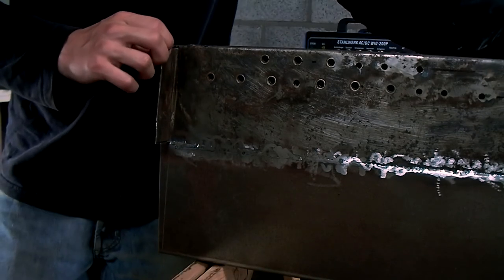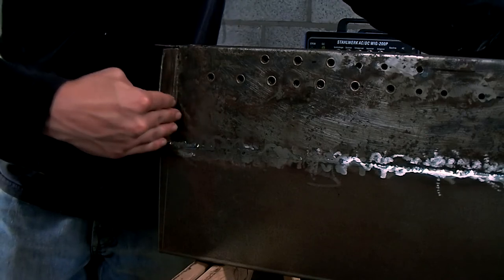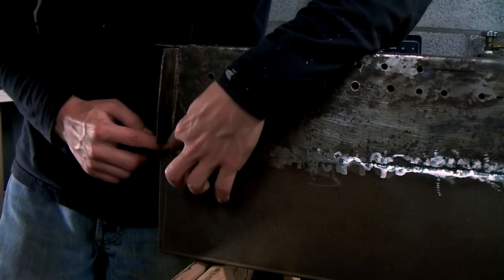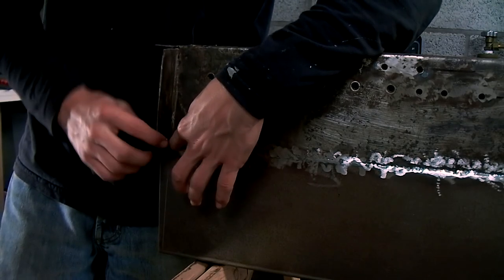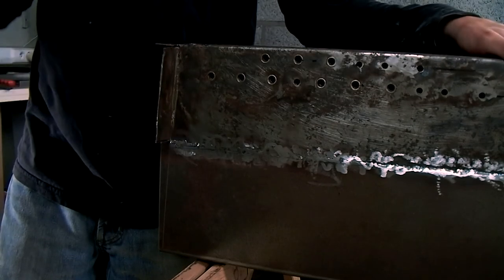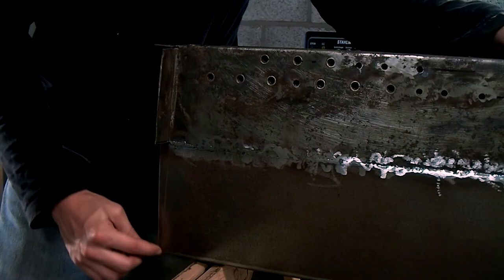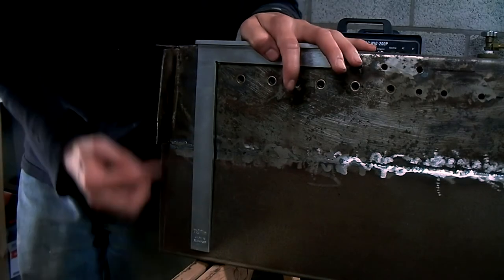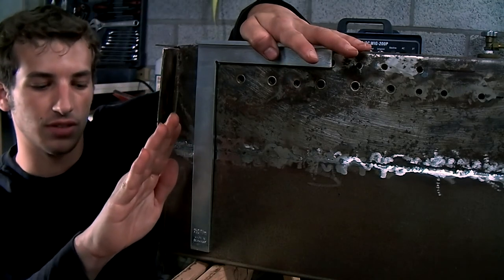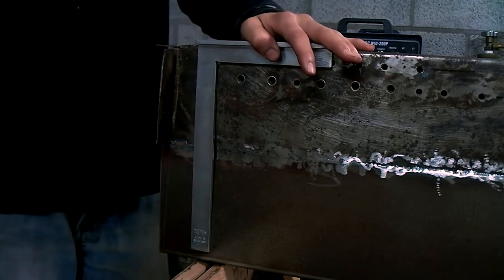The second reason is because it's only welded on this edge, there's a lot of slop in here, and this piece of plate could move because there's nothing holding the joint of the backbone to the T-section. So all the movement in this flange would have just been slop between the rear suspension and the front suspension. You can also see this line that I've scribed on this metal. You can see that this line isn't straight. It's leaning 3 degrees towards the back of the chassis. This was designed that way to make the front suspension work.